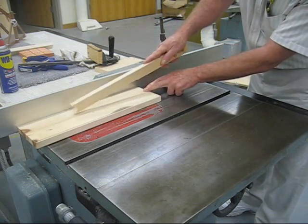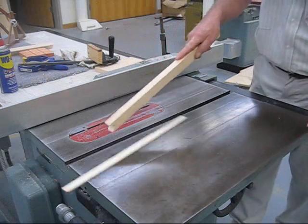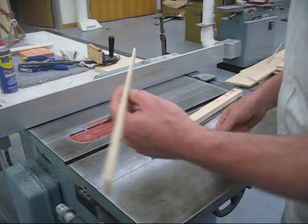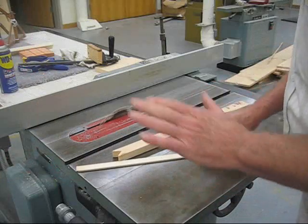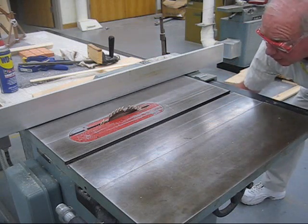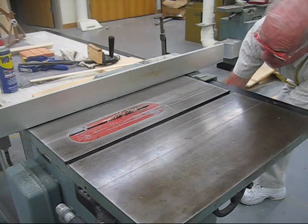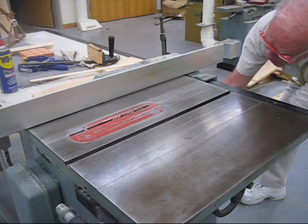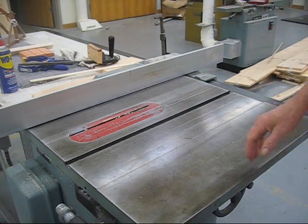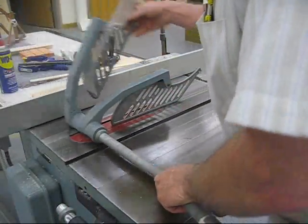Be aware that if you don't hold the material down, it can kick back up. Cut the saw off. Like that, you get a little strip and you get your board. I also recommend that when you are done with your cut, the blade be lowered down to the surface. This not only protects anyone who should accidentally be near it, but it also protects the blade — because you do not want to be tearing up a $100 blade.